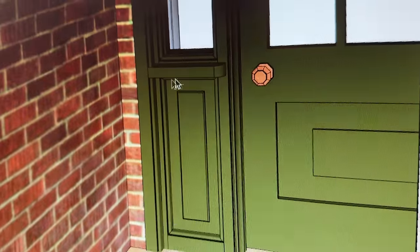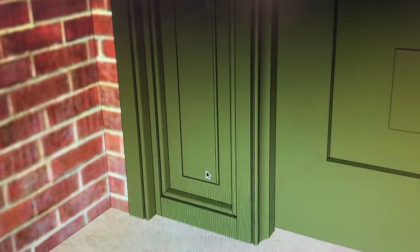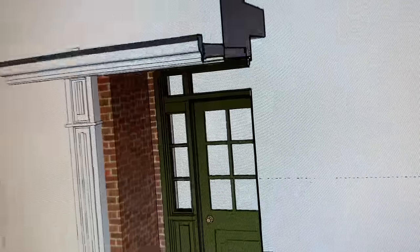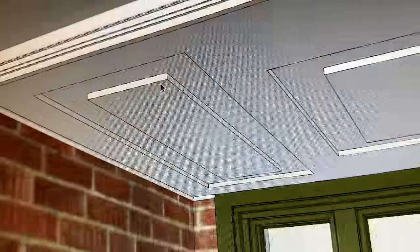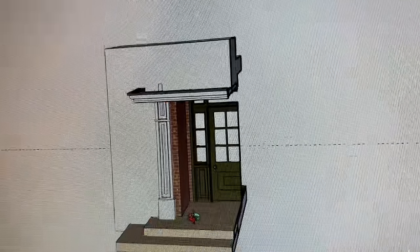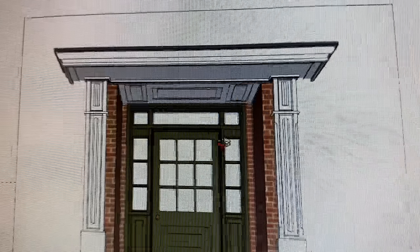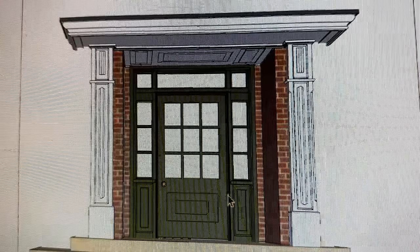So I've got to get beadings out for all of these panels, make the panels out of a couple of sheets of plywood if I've got it, if not I've got some Tricoya I can use, and also make these infill bits as well, a little raised panel that matches the detail up here in the roof. You've not seen that yet, it's not fitted and I've not released any video on it, but there are some panels to go in the roof there that I've made with a little bevel round that mirrors the columns of the door, and these panels mirror this section down here, how they're laid out.